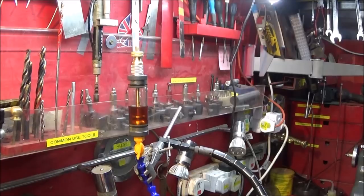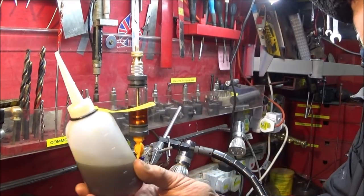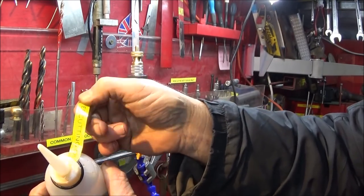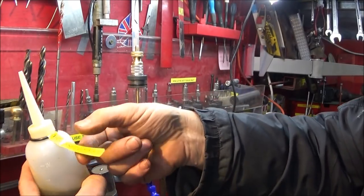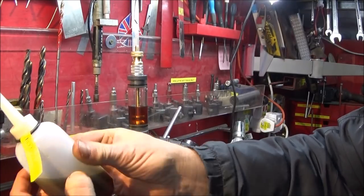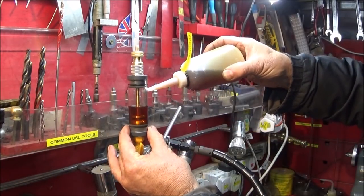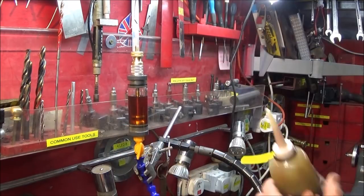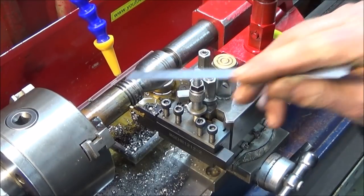To fill it up, I've got a side hole here and I use one of these sauce bottles. I put an O-ring around the top with a sticker saying what's inside, because I use these bottles for various types of oils. This one is EP cutting oil — if you write on this type of plastic it's easy to wipe off, so that's why I use a sticker. That just goes through the side hole to fill up.